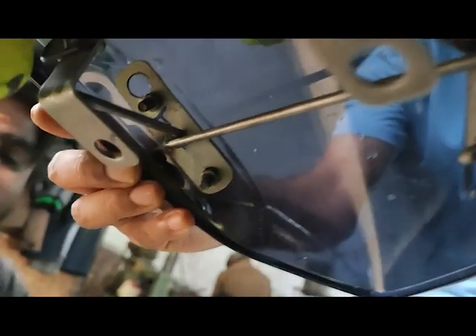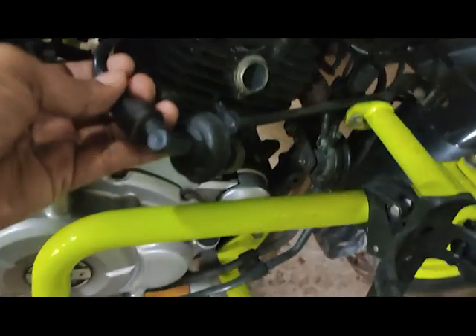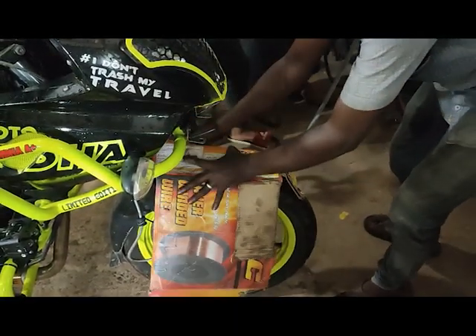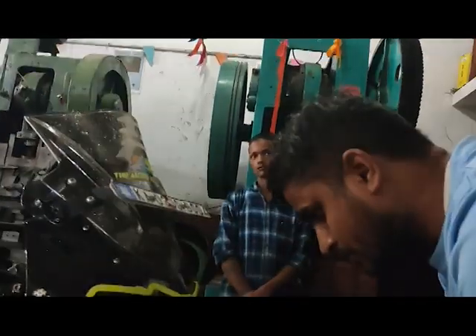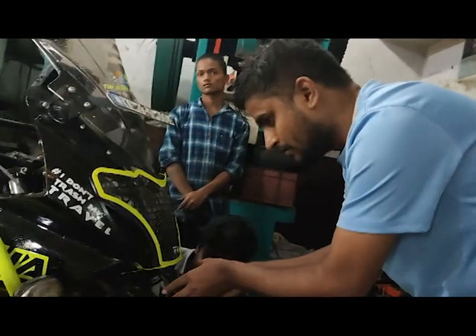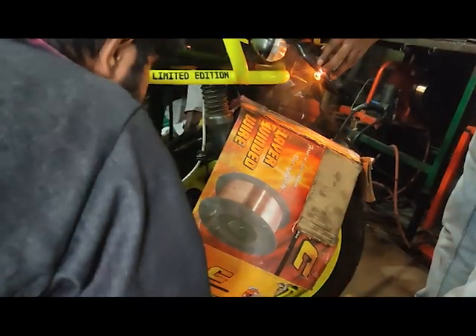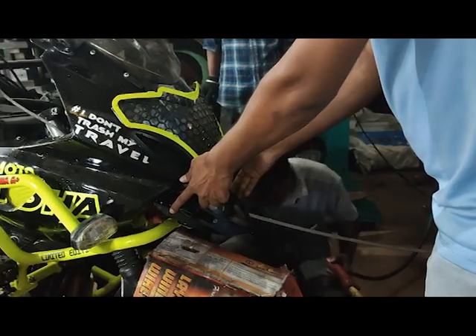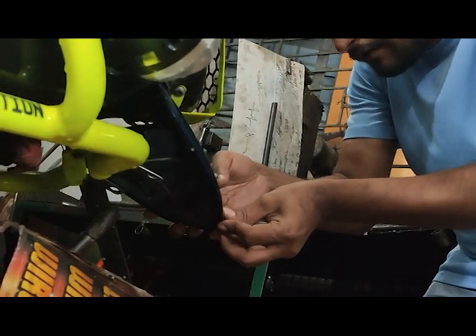Now it's been adjusted — you can see it's properly touching the flat pieces, and the other side is also touching. We need to weld this in position. Place cardboard for safety. Place everything properly, then weld one side first and check the position. Adjust the beak to the proper position, then once you're happy with it, weld it again. Keep a little bit of pressure towards upward so the beak sits firmly.